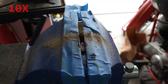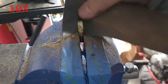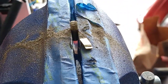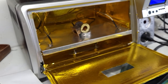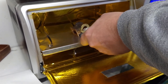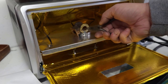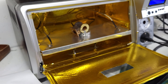I'd like to thank my viewers for various suggestions on what to do with this repair. I don't have access to brazing equipment, and scary heat tends to melt things when I'm around, so I went with this option. I know it's not the right solder, but we're probably going to run on compressed air so it'll be fine. The new barrels are only 25 bucks anyway. This is my reflow toaster oven — I was going to try and reflow in this. It's already been through two heating cycles to bring it up to temperature, and this is me applying some solder paste. This is just electrical solder because we're only going to run this on compressed air, so we don't need heat resistance. And then put the part in, and in theory this would do something useful.